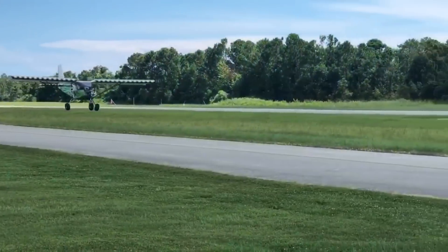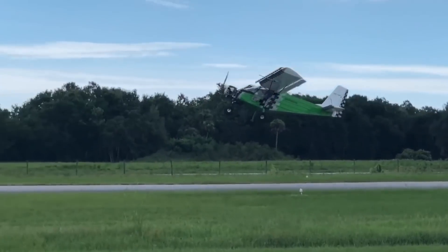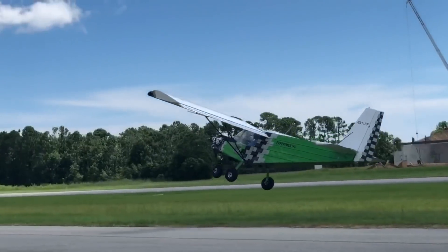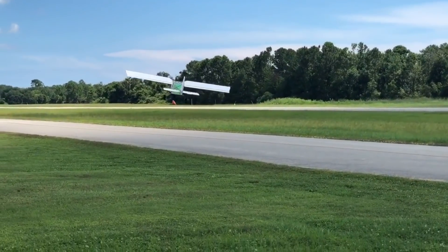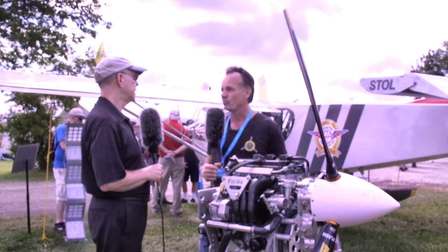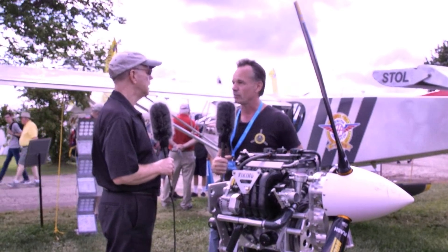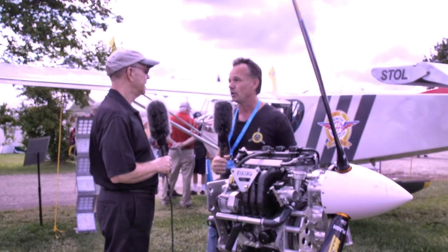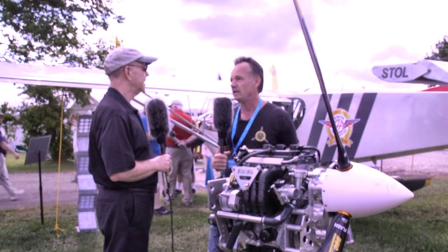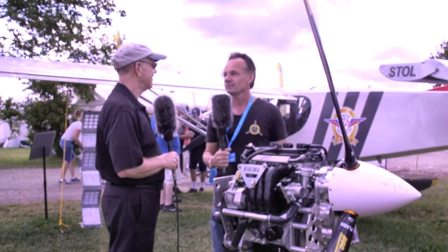Weight-wise and power-wise, you're pretty comparable to the 9-series Rotax? Yeah, we're basically taking an engine that weighs 123 pounds, adding a reduction drive, a radiator, an alternator, and an exhaust system, which then brings it up to 150 pounds — and that's very compatible. It's important for us to do a dyno run on these engines, so hopefully we'll be able to zoom in and see that in this video. The dyno curves and horsepower curves were carefully done and then overlaid on available Rotax information, and we have those three curves between the 80 and the 100 Rotax versus the Viking 90, both horsepower and torque, and it looks real favorable.